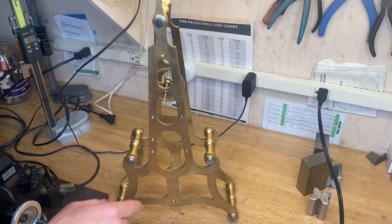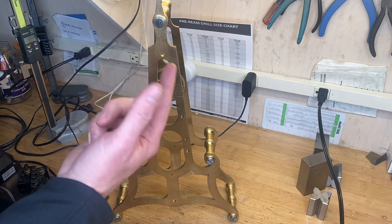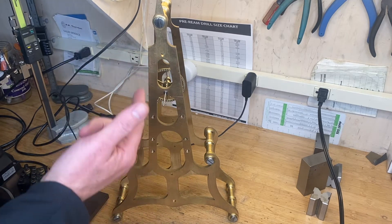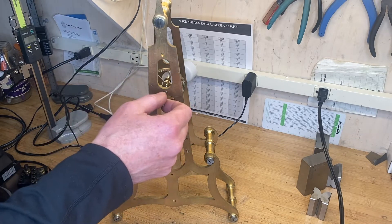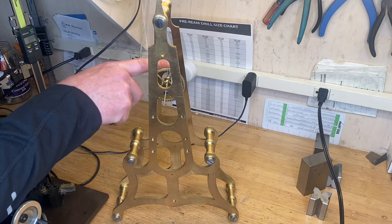In a clock, the train starts with a main wheel and then works its way up through different wheels — some people would say gears, but we call them wheels. The higher up you get, the more sensitive it is, and these things have to be perfectly concentric. If they're not, the runout will cause the clock to be very inaccurate, or usually it won't even run properly. So this has to be fixed.